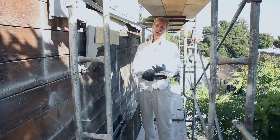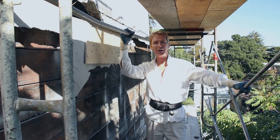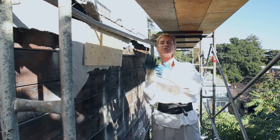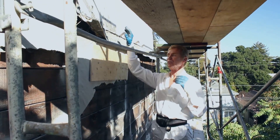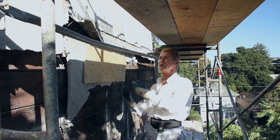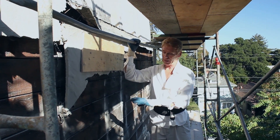Wear serious respirators — the kind used for welding. Don't wear a paper mask. I get a lot of this — this week alone I've looked at two places where the fascia boards failed and the owners were saying, 'How? I just had the stucco done five years ago, it's a brand-new house, it cost me seventy thousand dollars.' The fascia boards are failing because they didn't put the paper underneath. Put your fascia board on top of a peeling stick and allow us stucco guys to go up under it, and you'll save yourself a lot of this kind of hassle.